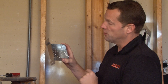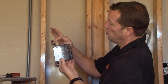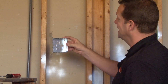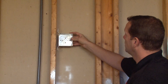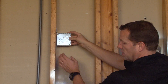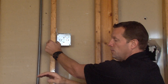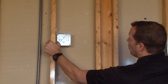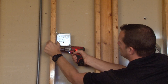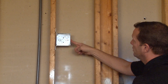It also contains a very versatile bracket, which is vertical in nature, and has four mounting holes in the top and the bottom. This allows the installer to quickly and easily place this box right on the face of the stud and either nail or screw on the bracket, like so, which gives a nice secure installation every time.